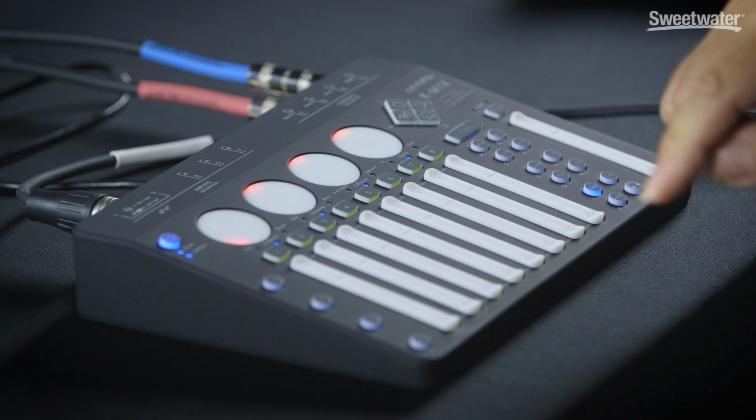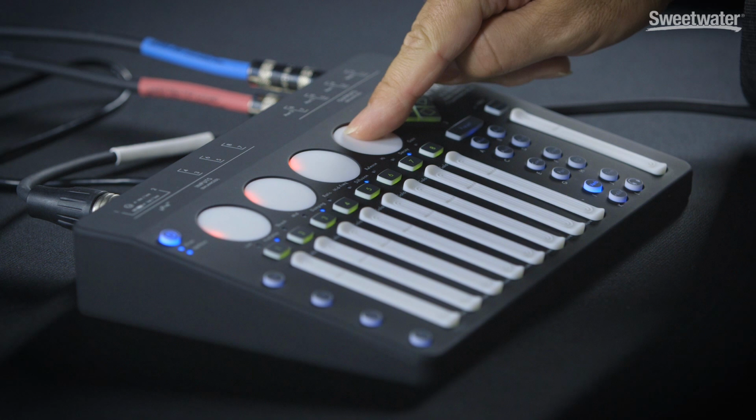As I mentioned, we also have built-in reverb. So if we select the verb button, now we have pre-delay setting here. We have damping, diffusion, and decay. And our channel sliders now become sends into the reverb.